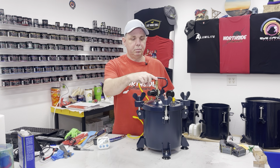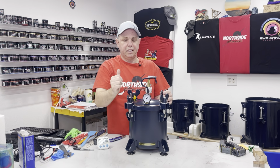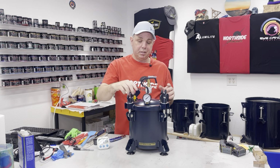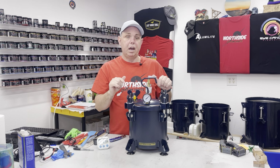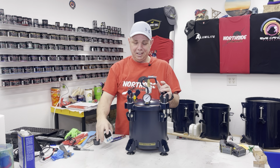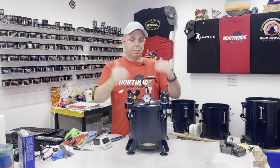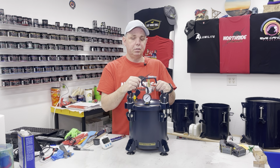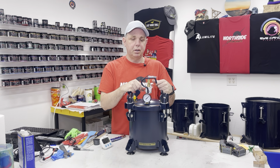136. I don't see the problem. It has a little bit less than 70 pounds in it. Everything's set from the factory. I didn't mess with the regulator. I didn't mess with the pop-off valve, but I will show you how to do that stuff. So once again, 1:36 out of the box, and we could be casting resin right now. It'll take you longer to mix your resin than it will to have one of these ready to go.